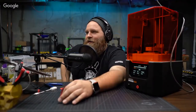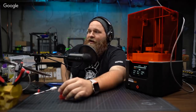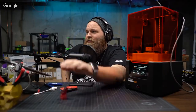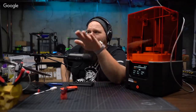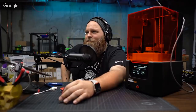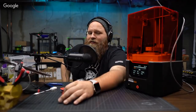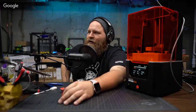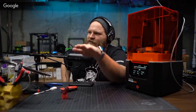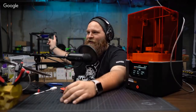Ooh, Ender 5 Duet. I wouldn't do the Ender 5 again. The Z axis is very wobbly. It's supported on one end, so when the bed does a Z-hop, the whole thing just shakes up and down. It seems to work fine. Switching to Duet, I was able to swap it over to 32X micro-stepping on all the axes. So it made it a lot smoother, but on fast prints it just kind of goes up. And that's why I bought a cheap printer, like $315 shipped.